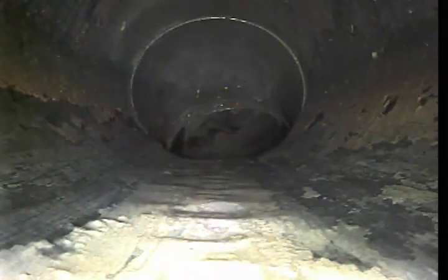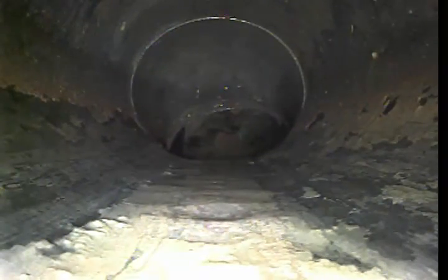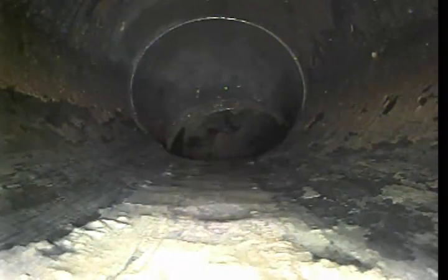And right there, you can tell that water just kicked on from the sump pump. It got full enough, so it basically just shoots up. Once that tank gets full, it shoots all the water out. So it appears to be working properly right now, but it wouldn't hurt to have that individually inspected. So I'm going to go turn the water flow on upstairs in the kitchen sink so I have water running throughout the line, and then I will turn it off on the way back.